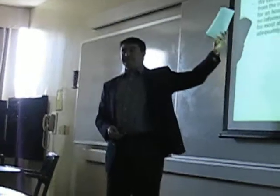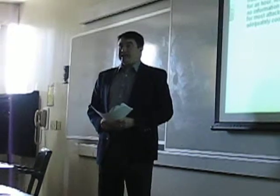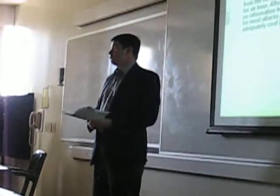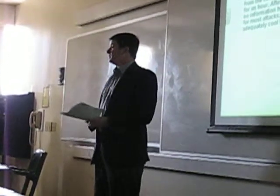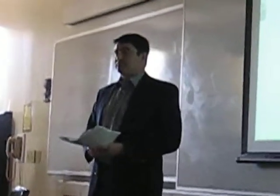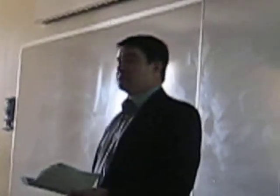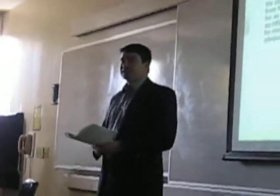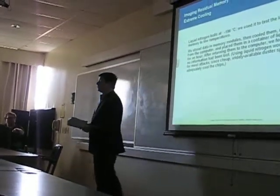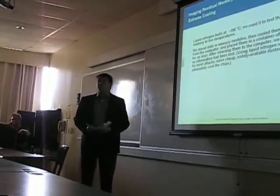Well, if we can chill a memory cell and reduce our refresh rate from 1,000 times a second to once every 10 seconds, we can reduce the power consumption of that circuit by a factor of 10,000. That's kind of interesting. How are we going to use that? I have absolutely no idea. But it's something to stick in the back of your mind, because as we are building computers with greater and greater performance, those types of characteristics could become very, very important.